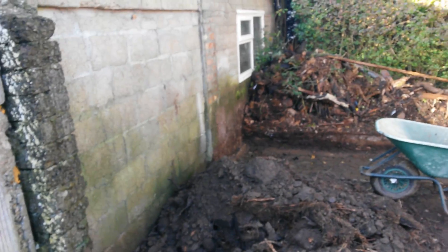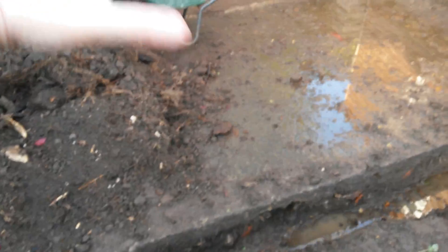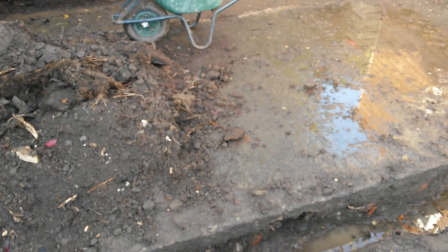They'll leave the wall until the concrete's in and the structure is built, then take that wall down once the new walls and roof are up. After that, they'll put down a self-leveling compound to make the floor perfect, joining all three pads up as one. Then they can take the temporary wall down just before that and run the self-leveler into the other part of the shed.